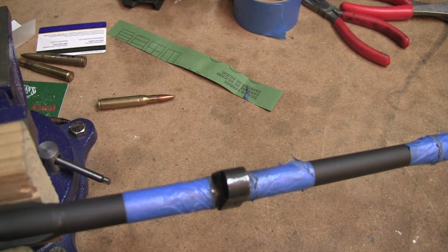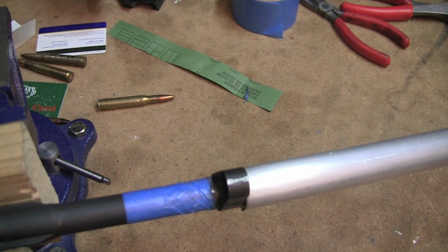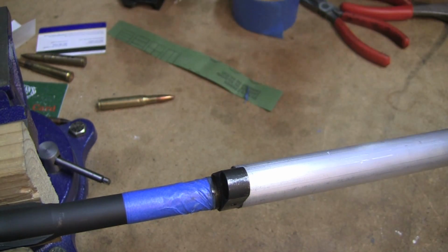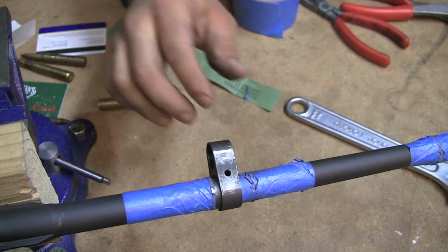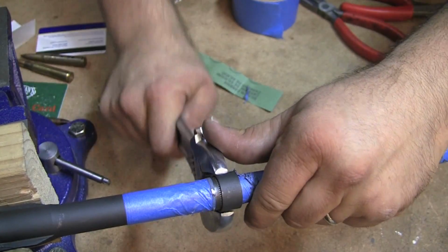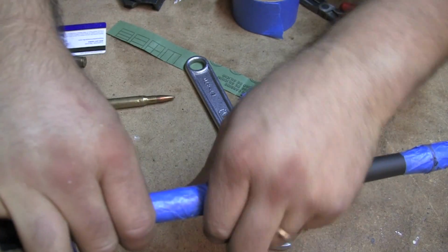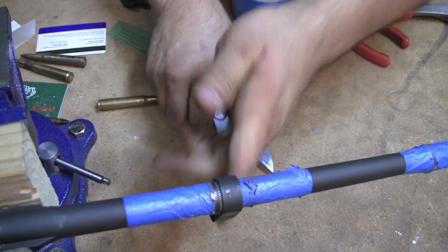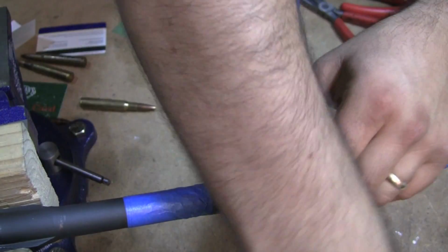Okay, so what I've done now is, after repeated attempts, I just slid this pipe over the barrel, and I kept using it as a slide hammer to hammer on the old operating rod guide and turn it with a crescent wrench, smoothing out that old knurling. So now I have my old operating rod guide, and I can use a wrench to keep spinning it around the barrel. It's not loose; if I can turn it by hand, it would barely be by hand, but it's really snug. And this is how you want it to be. So now I can rotate this around and get it off.